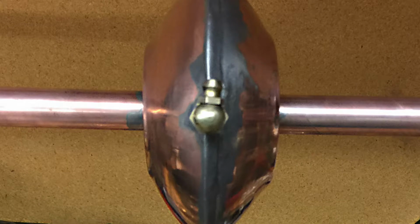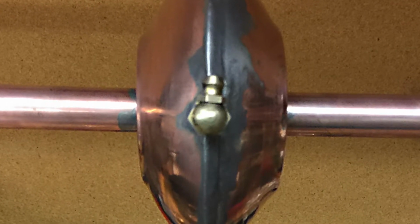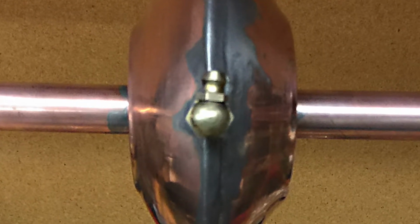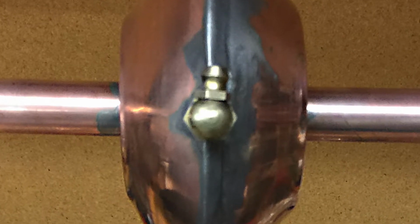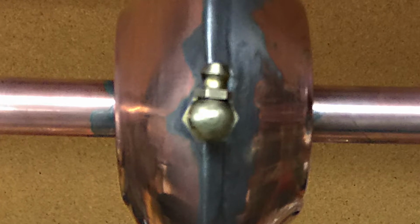The grease nipple is particularly convenient because the end of it can be unscrewed, and I can make different sized jets, put them on it, try different ones and check performance. And I discovered that the jets used in 3D printers also screw in with a 6mm thread, so they can be used as jets as well.